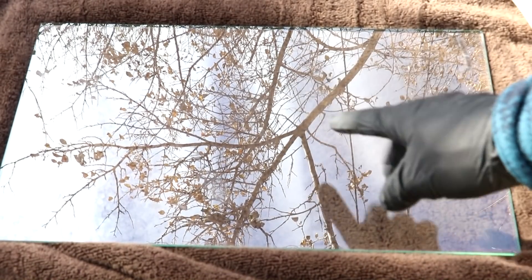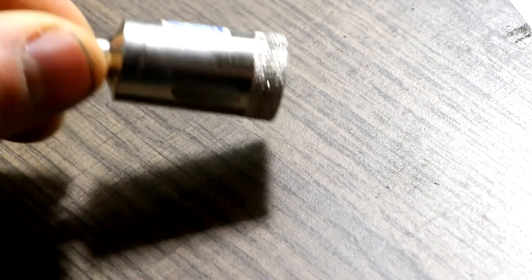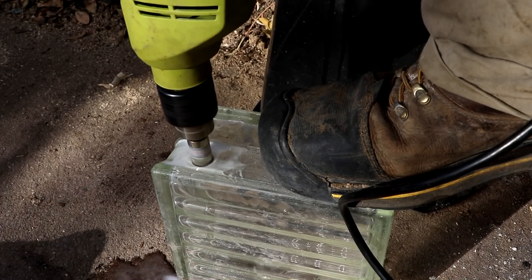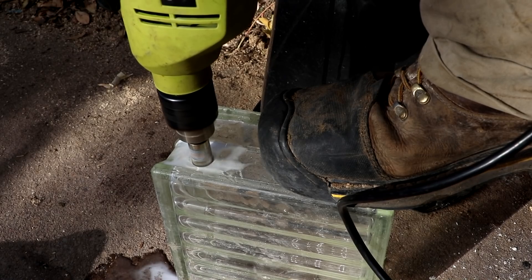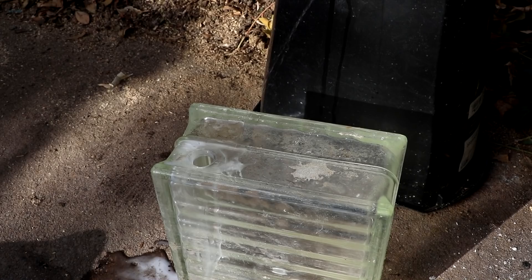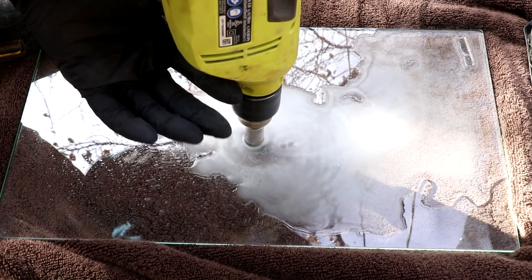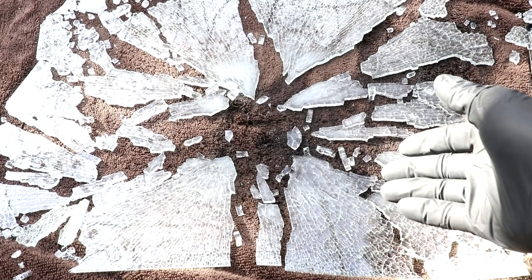As tough as this material is, it does have a weakness. Let's say I wanted to make a hole in the glass for some reason. I could use a diamond studded bit like this, which basically just grinds through the material. As long as I keep it wet, I can grind through a piece of untempered glass using this bit without any trouble at all. But if I try to do the same thing on a piece of tempered glass, it doesn't work. You cannot cut through tempered glass without causing it to explode. What's happening is if I can grind down to the center of it and introduce a crack to the area that's under tension, then that crack will be pulled open and it'll create a chain reaction which will destroy the entire piece.